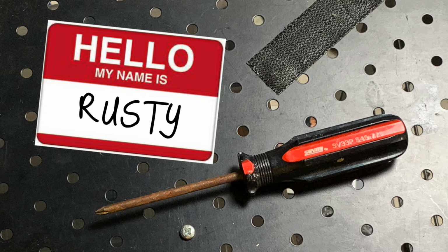Okay, first off, the things you'll need. You'll want a clean, well-lit environment, which is why I'll be shooting most of this from my desk. Seriously, find yourself a good spot to work on this so you can see what you're doing and you can find parts if they roll off the table. You'll also need a medium-sized Phillips head screwdriver. You'll also probably need something to attach the knobs to the pots, and that might be a little hex wrench or a small flathead, depends what kind of knobs you have.